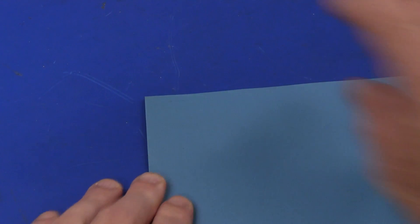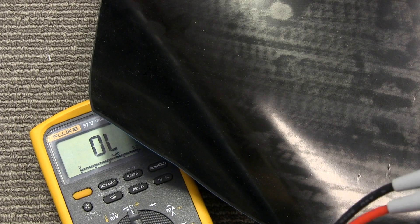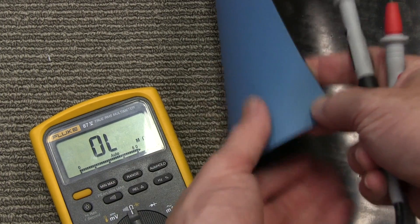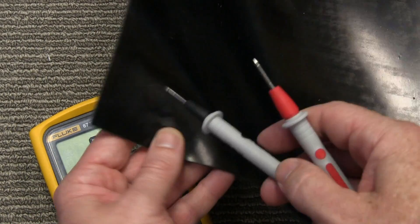It is exactly the same rubber ESD matting. Now I've covered this before in my previous bench build video, but I'll do it again. There are two different types of ESD workbench matting: the grey colored PVC ones, which are cheap but absolute garbage — don't touch them, because they will melt when you put a soldering iron on them and they're not resistant to chemicals. Whereas these rubber ESD mats are actually designed as a work mat — not just for ESD. They protect your bench, they're almost impossible to cut, and if you stick probes into them it might leave a little mark but it'll come back. You can put a soldering iron on these things and they won't burn. You can drop hot melt and solder on them and nothing will happen.